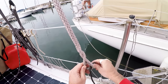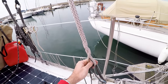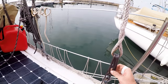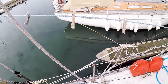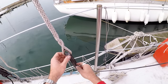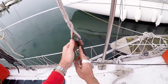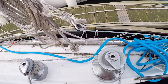With the dead eye you pass the lashing through the end of the stay and through the dead eye. For these smaller stays that don't have much load, I like to do four passes. It's really important that when you're doing the passes everything lays next to each other — you don't want anything over-wrapping or overriding, because when you go to tension it it'll just bind up on itself. By hand I'll get most of the slack out before we put it on a winch. The end of the stay leads into the dead eye, and the purchase system leads into a fair lead which keeps it completely in line with the stay. You don't want it forward or aft, because then as you tension it you're tensioning on a triangle and not a straight line.